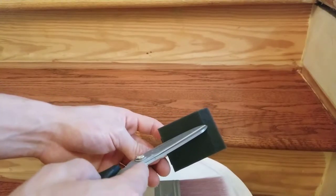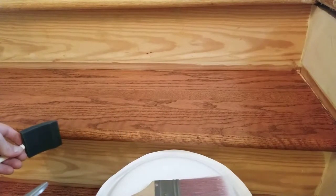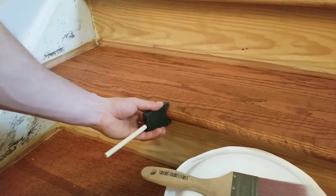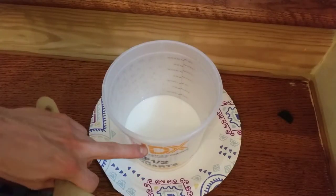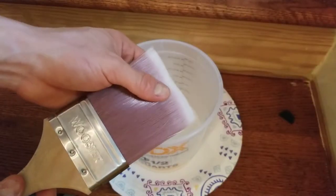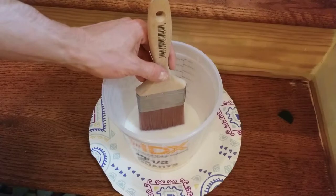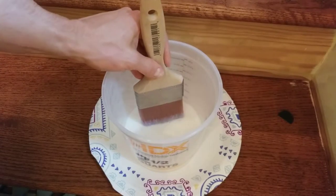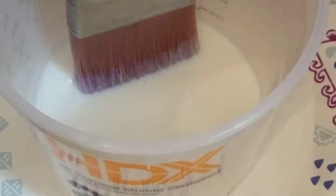The trick I'm going to try is cutting a notch in this foam brush so it fits perfectly around the rounded edge and gives even coverage. I've moved my container onto the step beneath for easy access and placed it on a paper plate so any drips fall on the wood beneath. I'm going to slowly dip my nylon brush into the finish and let it absorb into the bristles — there can't be any air inside the brush or you'll get air bubbles. I'm going to slowly flex it back and forth; you can see those air bubbles coming out of the bristles.